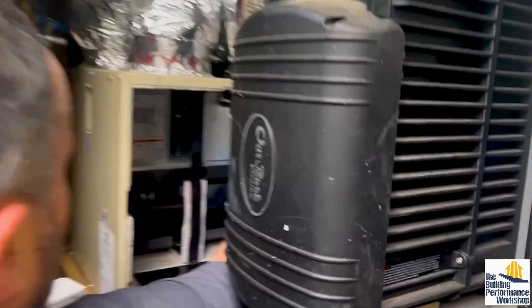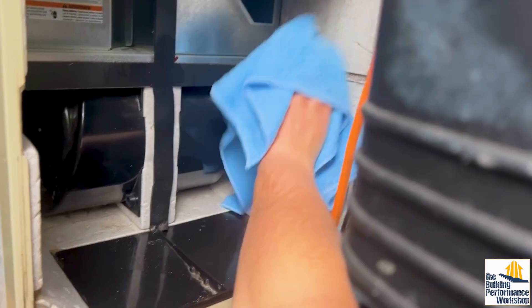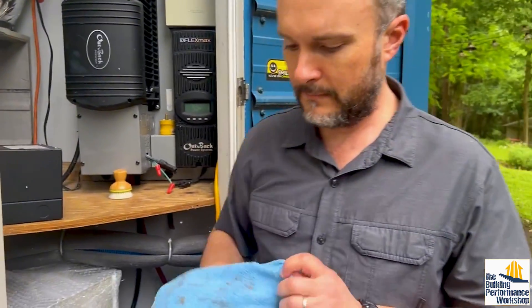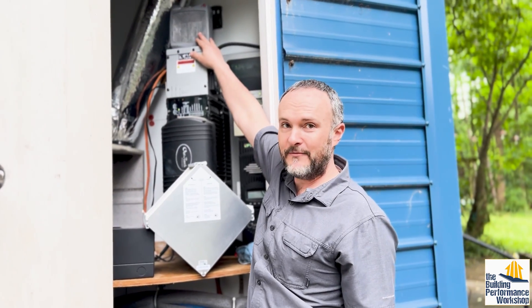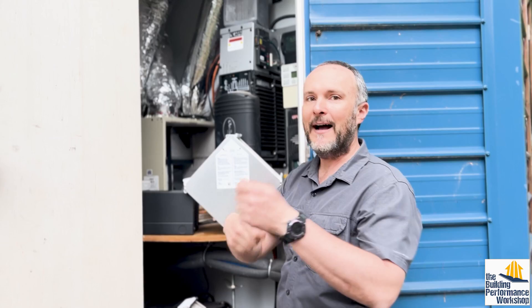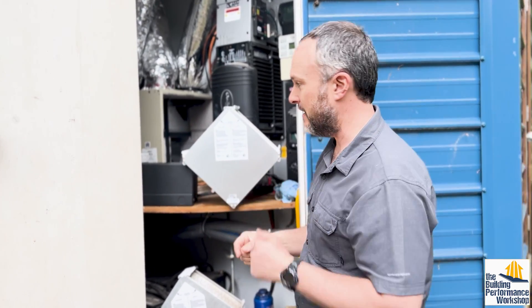In the mechanical closet in the front of the tiny house, this is a buffer space. Buffer spaces are like outside in every way except no animals, precipitation, or wind. The way that we look at enclosures, you should have every room in your house be either totally inside or totally outside. This is a totally outside space, but it is protected. We've got a little heater in here to make sure that our plumbing doesn't freeze, and that's hooked to an automatic switch that monitors the temperature.